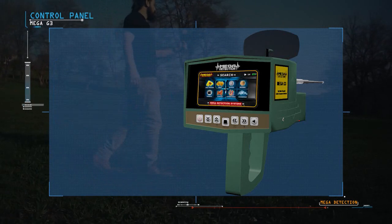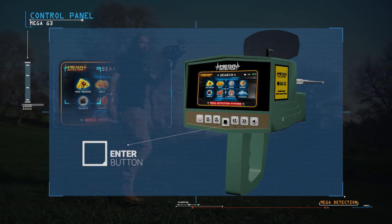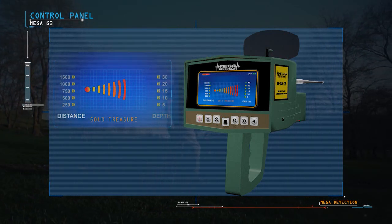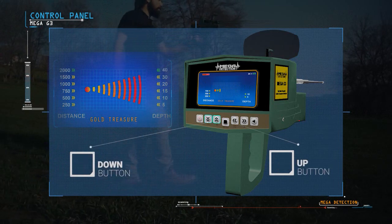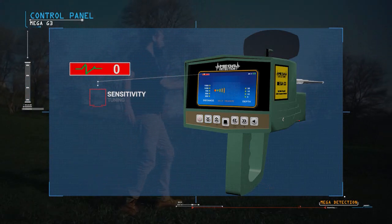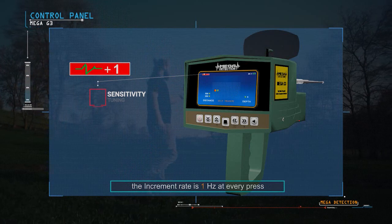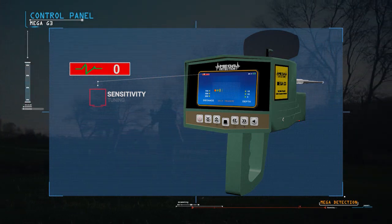After selecting the Long Range Locator System, the targets menu will appear. Select the appropriate target by pressing the enter button, and the program loading screen will appear showing the program name with a table of distances and depths. Switch between distances and depths using the up and down buttons. You can adjust the precise frequency by pressing and holding the down button until hearing a different tone, then changing the value with the right and left buttons — the user can increase or decrease the frequency up to 12 Hz, with an increment rate of 1 Hz per press. It is preferable to leave the precise frequency on the factory default at zero.